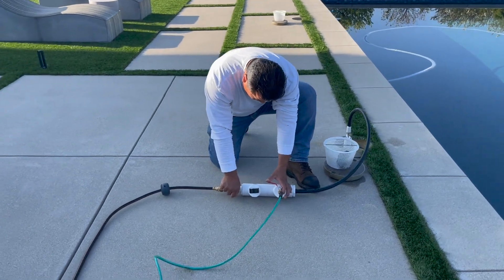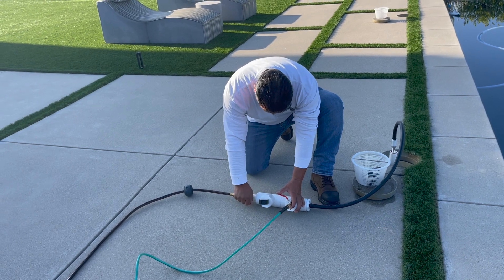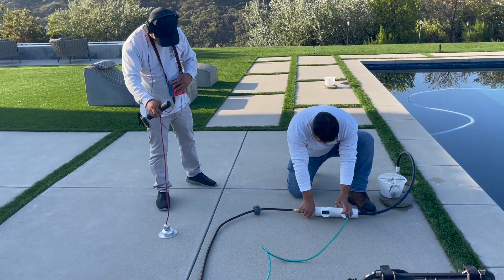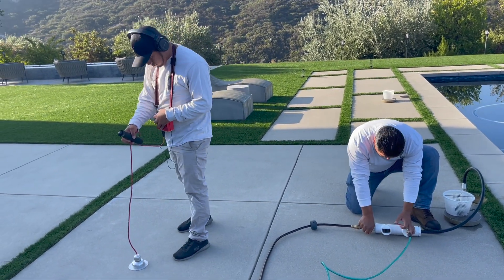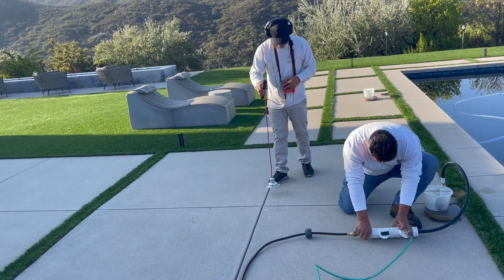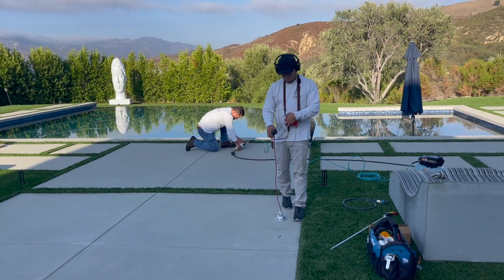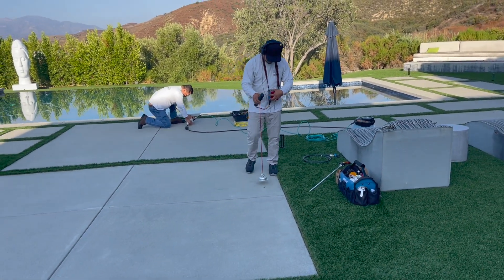We have a pressure drop, and once we have that pressure drop it confirms the line is leaking. We also start listening with our deck plate — air and water combo, never going more than 12 psi altogether. Bring it up with water, then with air, and he's listening for that exact boiling sound, which he heard back by where William is pressuring it up from.